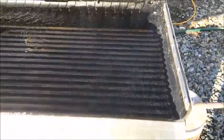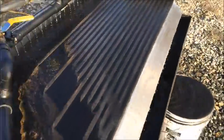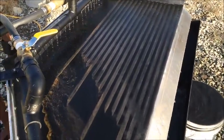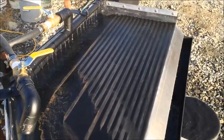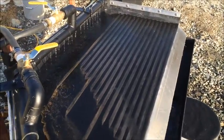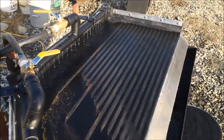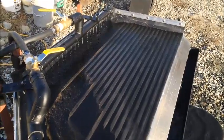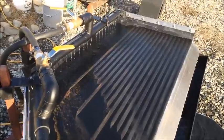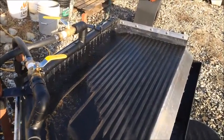There is no bump in this table, there is no jerk in the table. It's a very smooth action. One of the features for catching fine gold is the grooves. Another is the low slope of the table. And then just the very gentle action of the table that moves everything over to the left. It's really a very gentle and smooth process so you create as little turbulence as possible.